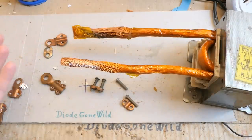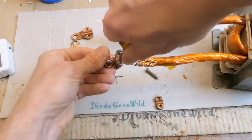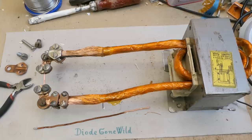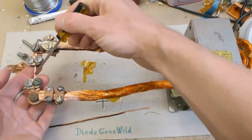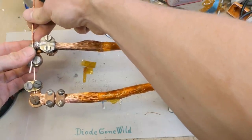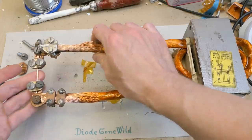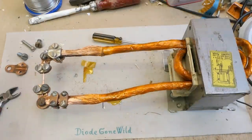Let's tighten this onto this using those pieces and do a similar thing with the other one, then test it and take some measurements. Now it starts to look a little bit like a spot welder. I can now mount the wire into it and create tips — it's basically a spot welder with replaceable tips. I can also put a longer wire in it and keep sliding it as the tips wear off. First let's test it in short circuit to see the short circuit current, then cut it in the middle and create tips for spot welding.